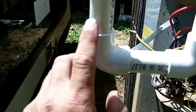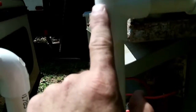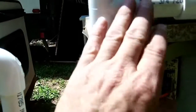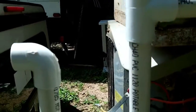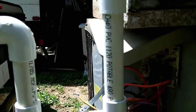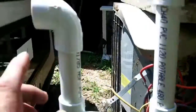Of course you come down, and then the outlet of your trap has got to be shorter than the opening of the trap — very important. If it goes any higher, it won't drain. The outlet needs to be lower than the opening. You have different configurations: sometimes you just have a condensate pump sitting on the floor and you take another 90, bend it down, and go into your condensate pump.